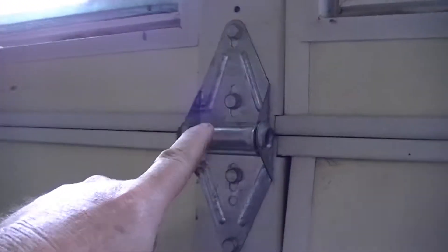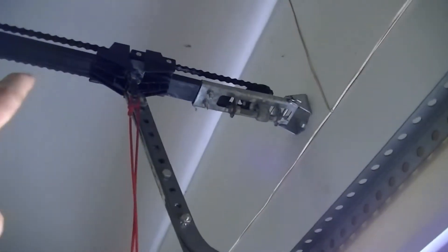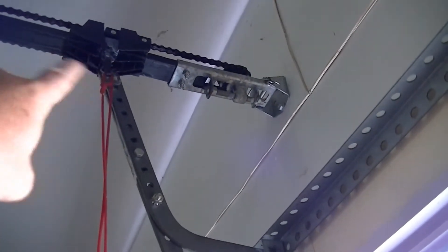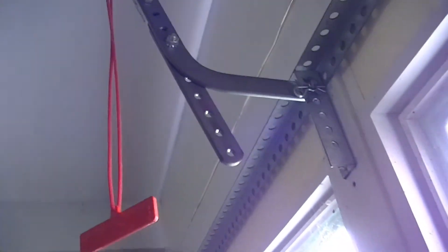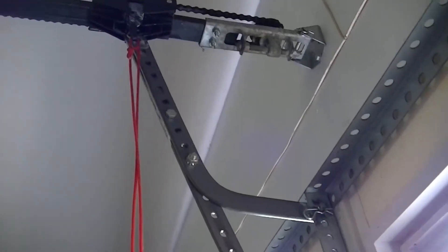To really help your door out, what you do is come to all these hinges and spray right here and here — you've got to do those all the way down and all the way up. You don't need to do the chain, but you do need to do the top of that rail where that little black thing slides. So just clean the top of that rail off and then put some grease on top of it.